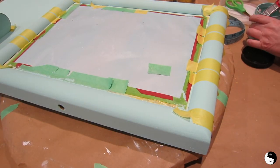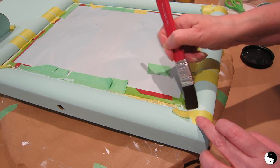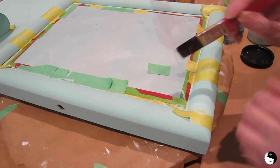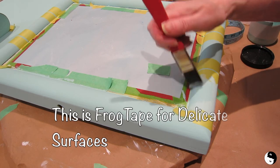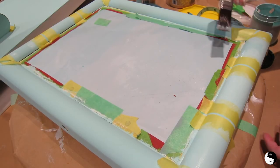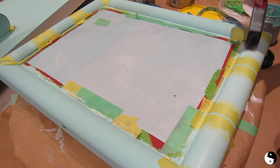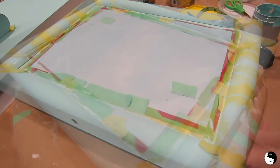Occasionally just check that you've got a two-inch space between your tape so you're not getting off kilter. I'm going to take a piece of tape along the bottom edge so I can't paint past that point. Don't forget to burnish your edges. Now that the top and bottom are taped, I'll take a touch of the same color paint and run it along the edges to seal them — that way I won't get bleed-through. Anything wet that hits this tape will activate and seal the adhesive.